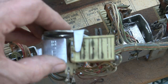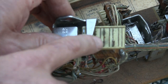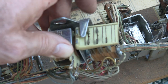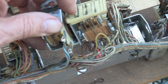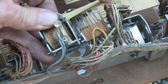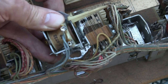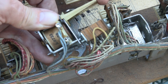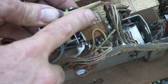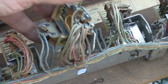You can look at the leaf switch configuration. You'll see there are two blades — one of them will stick out more than the other. If the top one is sticking out, that's going to be a normally open switch that closes when it energizes. All three of these switches here are normally open. Although you can see this bottom leaf is actually out of alignment and it's closed all the time. When you're working on these machines, you can take a piece of white paper and put it behind it — it's easier to see whether there's a gap between these things. That's how the switches work; these little magnets control it, and this is your basic switch stack.